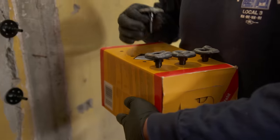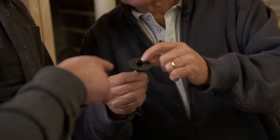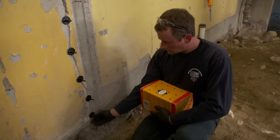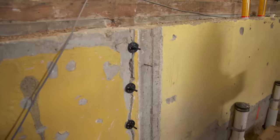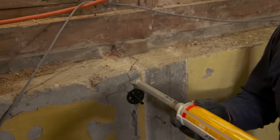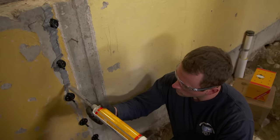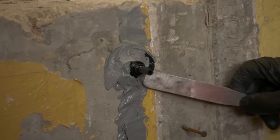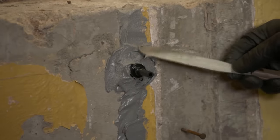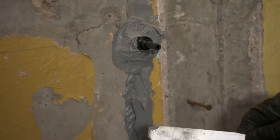I'm surprised that when you push that on the wall, it doesn't block the hole for the epoxy to go into. When they designed these, the center piece is protruded — it almost acts like a little dam to keep the epoxy from getting in there, so there's a little ridge that prevents it. As it squishes in, it doesn't block that hole. What he's doing now is using that fan tip to bridge across the opening, working his way right down the crack. He'll tool that smooth and switch over to the low-viscosity material, almost like water, which acts as a dam so that the grout can travel behind it.